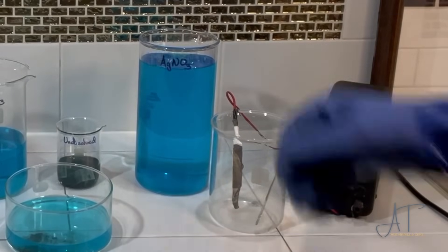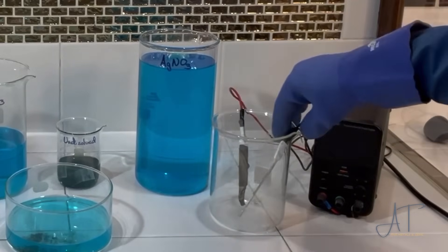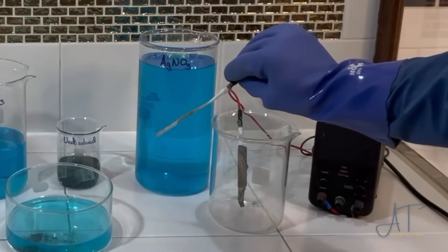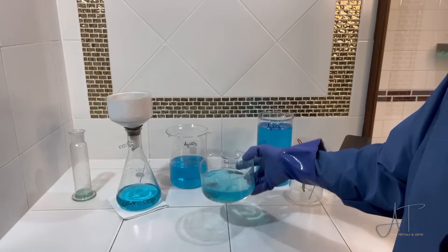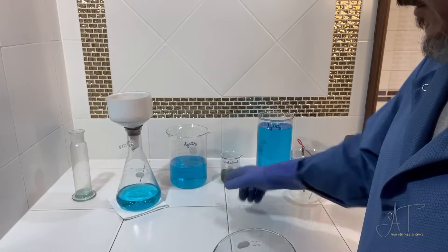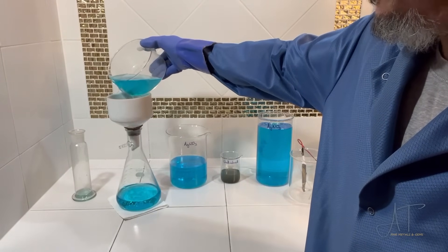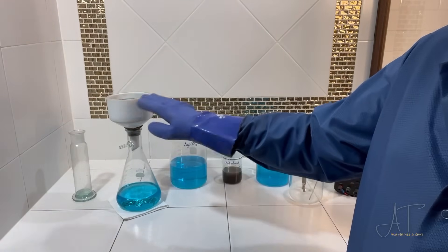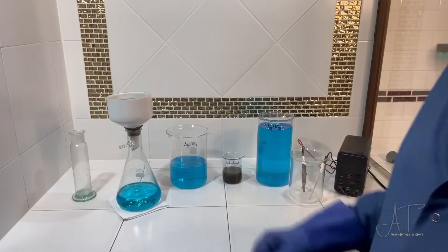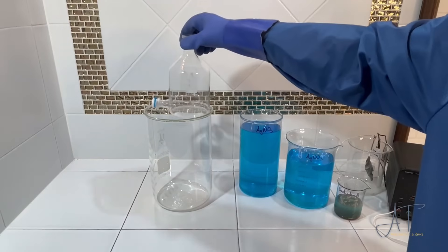I've just about filtered all the electrolyte, and here's what the anode looks like, and the pure silver cathode. I'm going to filter the solids back in with my electrolyte and keep all of the solids back in the undissolved beaker. We'll see how much nitric acid it takes at the end to get everything fully dissolved. When this is done filtering I'll rinse the solids from that filter paper into the undissolved beaker. Now to keep the sterling and the pure silver separated from one another, we're going to use the aspirator bottle.